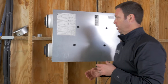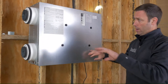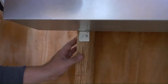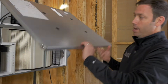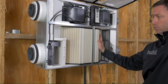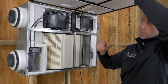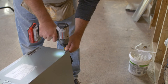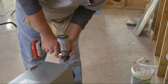So let's talk installation now. This unit can be installed in a couple different manners. In this case, we're in a mechanical room on a new house we're building. I had a great wall in this mechanical room to install it to horizontally. I like this kind of install because now you've got great access to turn the unit on or off, to look at the filter reset and the maintenance button, and if you pop the cover off, you've got full access to vacuum it out. About every 90 to 180 days you're going to have to do some vacuuming or change the filter, so you want good access. Another option would be to hang this unit from a ceiling — if you had an attic and no wall, you could hang this from the rafters using four chains attached to the ports on the corners.